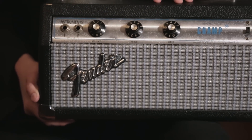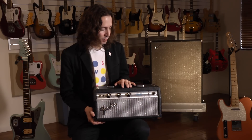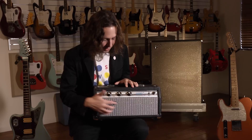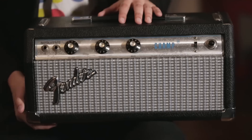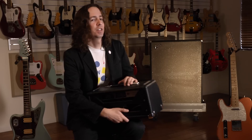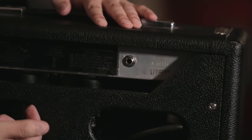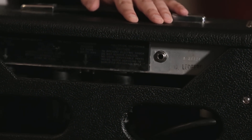I took the chassis out, then went on some Telecaster guitar forums online and found someone who built me this box to kind of the specs of the old Blackface/Silverface era. I know it's not exactly period correct — the grill cloth and logo — but it's pretty close. I also had my amp tech Palmorte in Orange, California put in a quarter-inch out on the back for the speaker, because usually the speaker out is right under here where this arrow is, and it's an RCA. But if you're on tour with this thing, it's so much easier to have a quarter-inch out like your other amps to go straight into the cab.